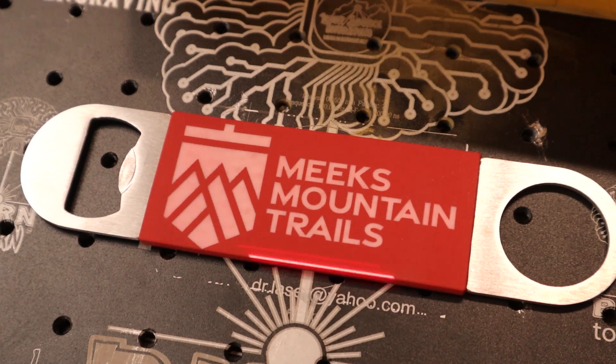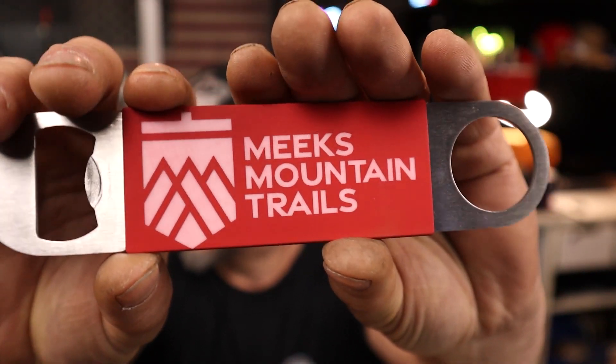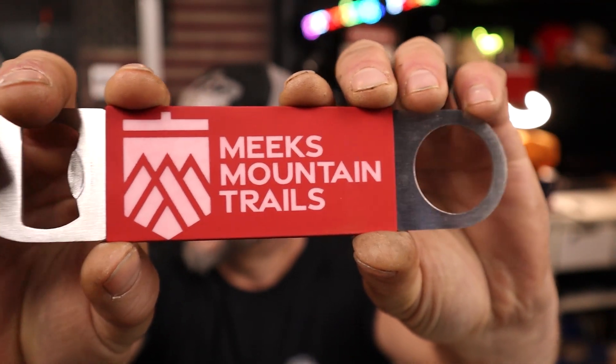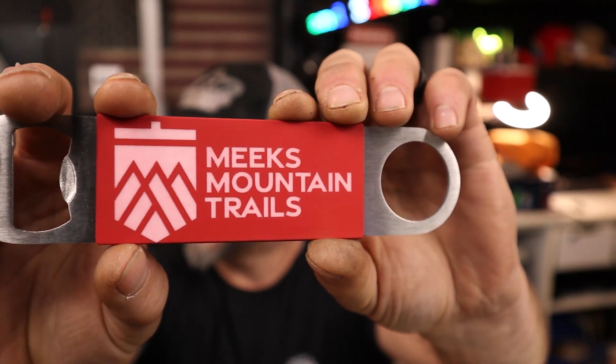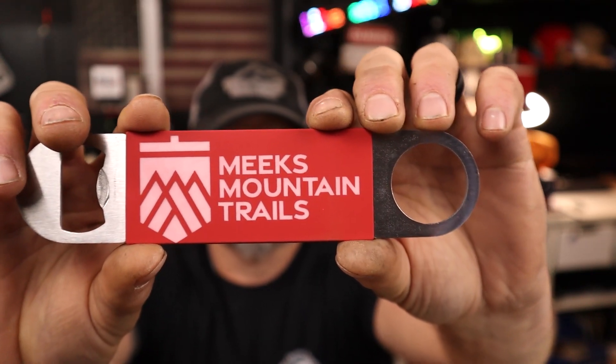This red isn't as bright as I wanted it to be, so I'm going to run one more pass and bump the power up to 80 and see what we get. I think that's looking better — I'll run one more, I don't think it's going to change too much. This particular red silicone I did two additional passes and those made a big difference. Now we have a nice bright finish on that red.